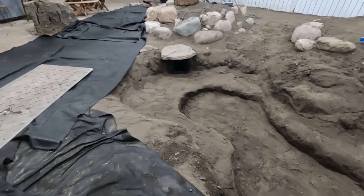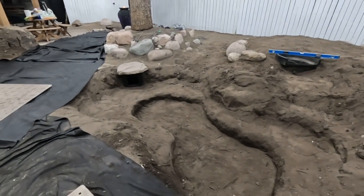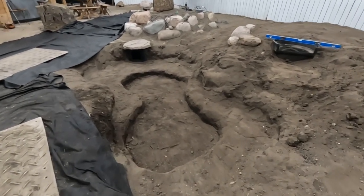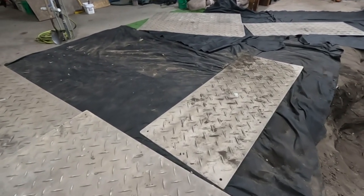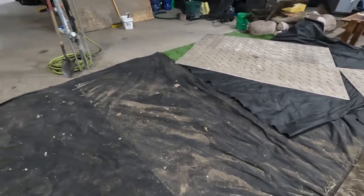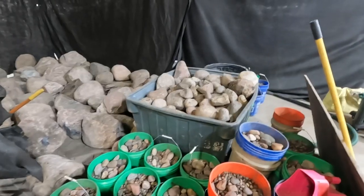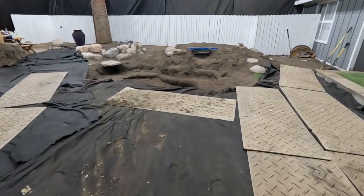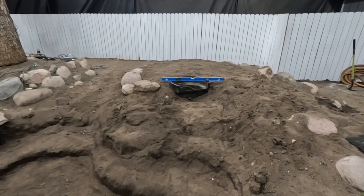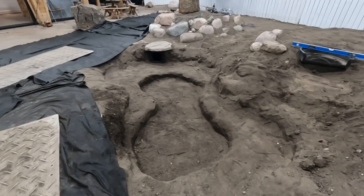Normally you guys see our features being built at the end of a project, but this one you're seeing a hole in the ground — with our skimmer and biofalls staying in because of the academy, we need to keep those in there to streamline our process. Everything is covered up and we still have a little bit of things to do. We're keeping the plywood and fabric on our turf so we don't mess anything up. We probably have two dozen buckets of gravel, a gaylord of cobbles, and all of our granite — probably four or five tons total that came out of this hole. A 15 by 20 liner was used on this project, a Skimmer 1000 and a Signature Series 2500 Biofalls. I just wanted to show you guys how Team Aquascape removes a pond.